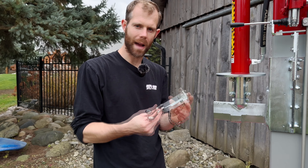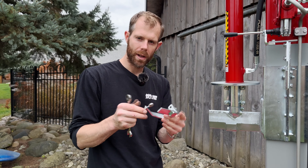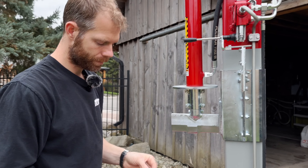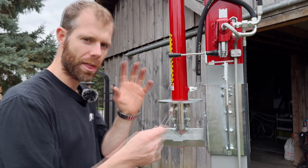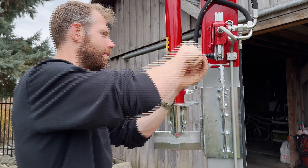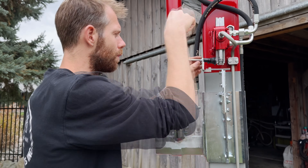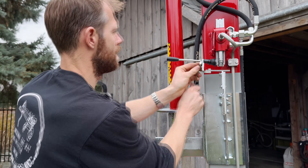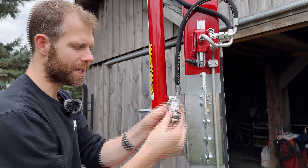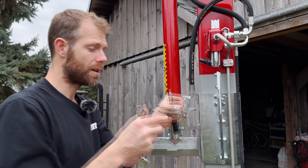Next is our neutral lever. This neutral lever is a whole bolted assembly — it comes tight and ready to go, you should not need to do any adjusting on this piece. We're going to remove the existing control using a half-inch wrench. If you've got a 13 millimeter it might be slightly easier as it's a little tight for a half inch. Keep in mind that the valve is going to want to spring up right away. We're removing this piece and not going to reuse it — keep it around though in case you need the spring steels in the future.